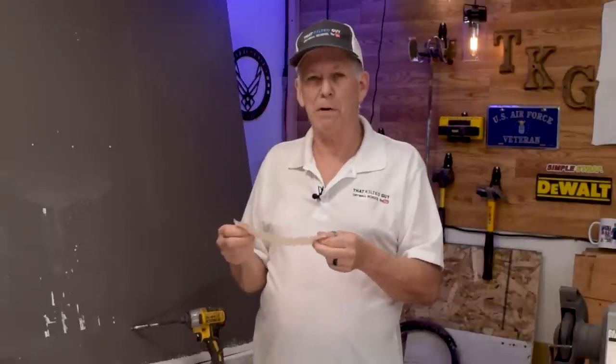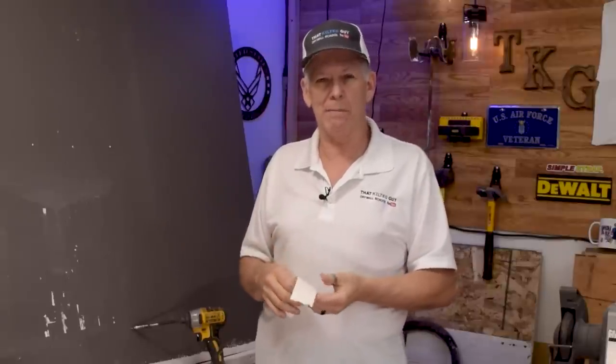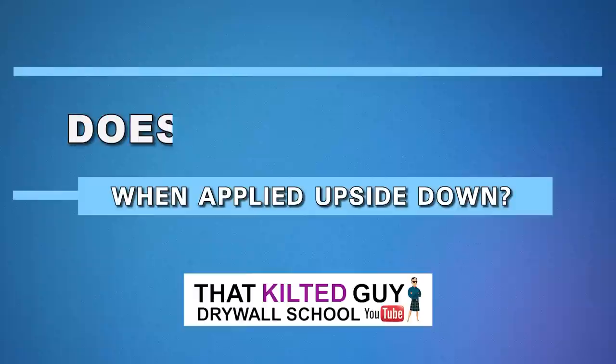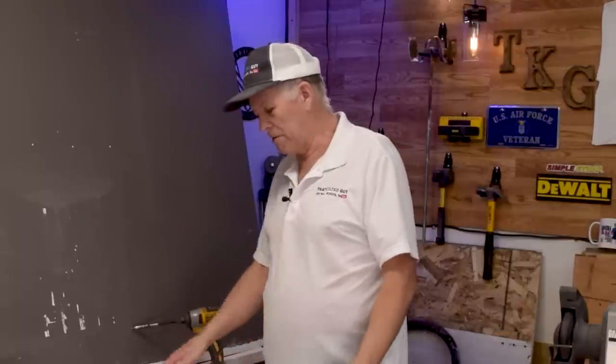In the old days, they used to call this perfitape — at least some brands, and they probably still do somewhere. The theory was that it had tiny little holes that allowed the mud to go through, and maybe you had to have it one way versus the other. I honestly think that was all a marketing gimmick; I don't think they need that anymore. I'm going to show you pictures of how there's actually a raised nap on all of this paper. I think they do that on purpose — it's paper, it kind of has that. But this isn't meant to be smooth; those little fibers help the mud grab onto it. But mostly it's the fact that there's some adhesive in it, and it's just meant to stick to the paper.